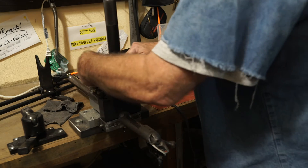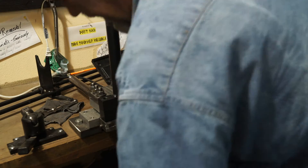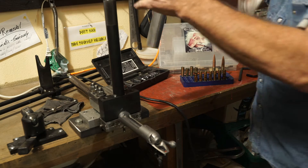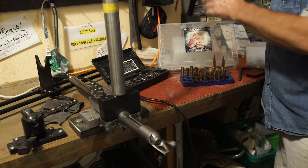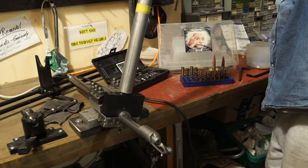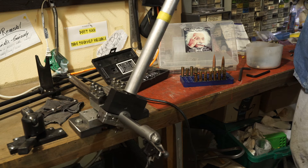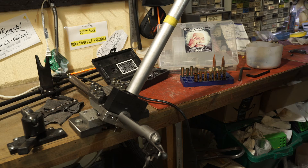Savage thread — I don't do a lot of Savages, so I think there's 20 threads per inch. I'll go ahead and stick my leverage bar on that. Grab my bow scale — you've seen this before — reach up out of the camera and give her a lash. Advancing nicely. I gotta see where I'm at here; lighting's a little funky.